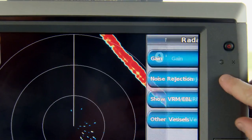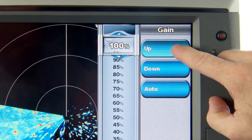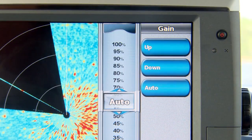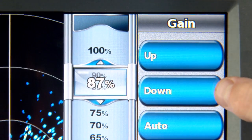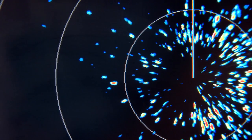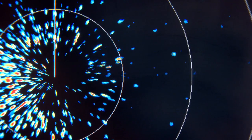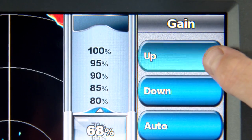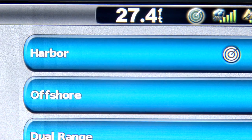The first option in the menu is the gain setting. The Garmin unit defaults to auto-gain to give you the best radar picture. If you want to see more radar targets, increase the gain setting — but increase it too much and your screen will be cluttered with false returns from waves. A good rule of thumb: slowly increase the gain until you start to see some light clutter on screen, then back it down just a hair. You can set gain manually for every radar range — turn gain down at close ranges to avoid wave clutter, and up at longer ranges for marginal targets. Or simply leave it in auto-gain and select harbor or offshore mode.